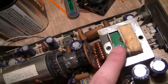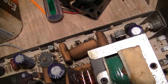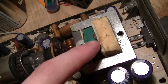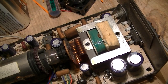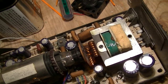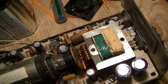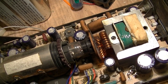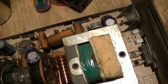Inside there's the transformer which supplies all the various supply potentials used by the camera. Something worth noting is that early cameras like this often used the mains electricity 60-cycle frequency — usually 24 volts, but some are 120 volt — as a simple means of providing synchronization, because early video multiplexers couldn't handle asynchronous video inputs.